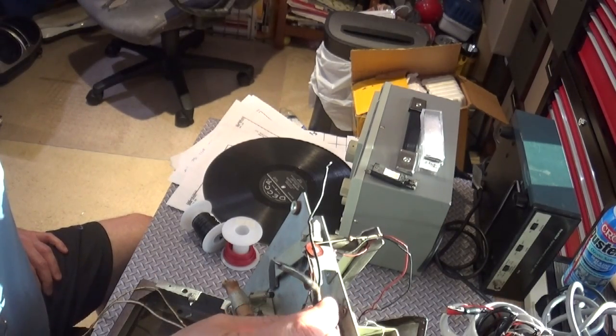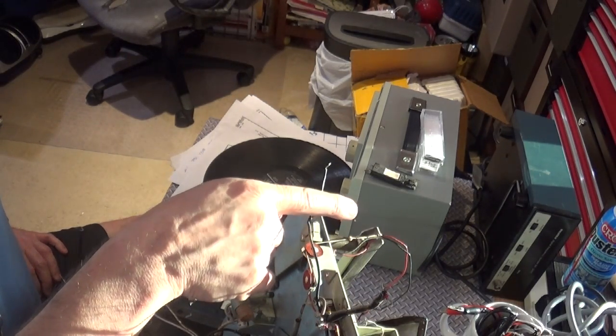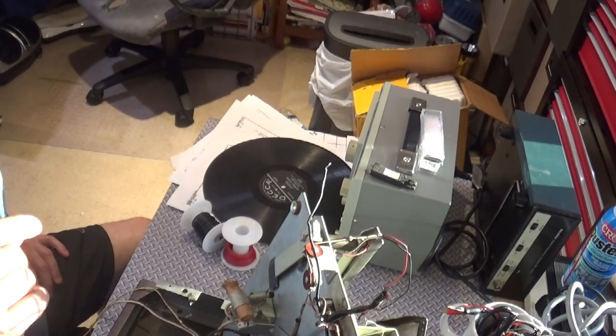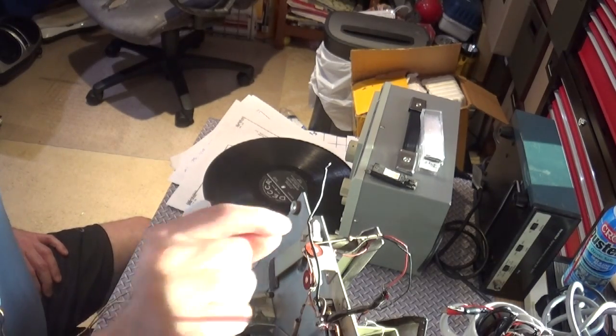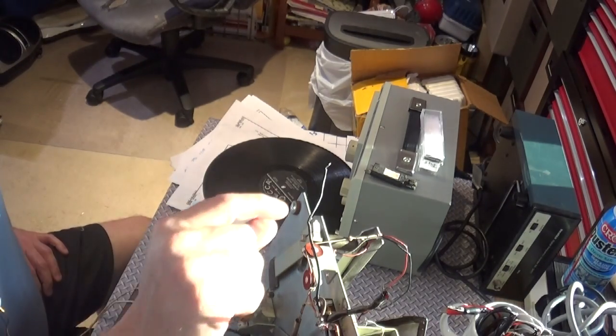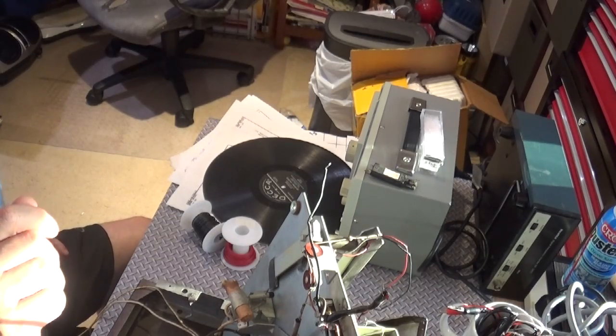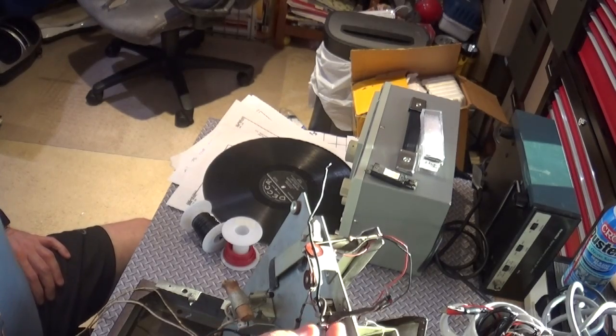So I think what's happening here is the ground that's being used by that tone arm is really grounded through the entire chassis, if I understand this correctly. So I'm going to modify the circuit and experiment. I'll use gator wires before I do anything permanently. But I think I'm going to actually ground the cartridge correctly to the chassis, because right now it's not. Remember, the black wire is ultimately making its way to this shielding. And I think that's part of my issue. But I'm going to experiment and play with that, and I'll have that in my next video.